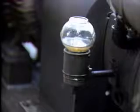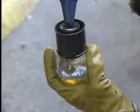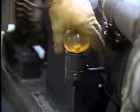The bottle reservoir should be nearly full. To fill a bottle oiler, turn it upside down and pour in new oil until it's full, then put it back in the cup. The main thing to check a bottle oiler for is a faster than normal drop in oil level — if that happens, there may be a leak somewhere that should be fixed as soon as possible.